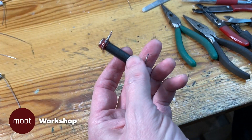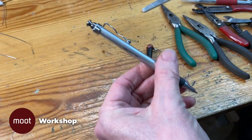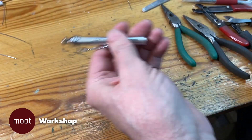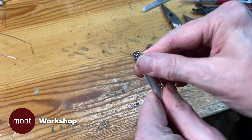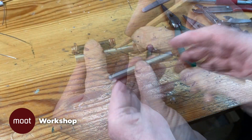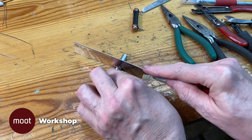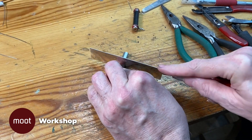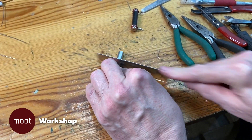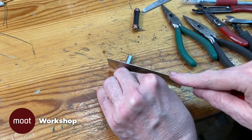Last but not least, I have to address the final resistor. The reason I waited on this one is it's a little bit different — a little bit larger than the previous ones. Fortunately, I have this pen whose barrel is the right diameter, or close enough. So just like the others, I'm going to cut a piece out of this pen barrel. Then I have to figure out what to do about the end caps, because on the original they have metal end caps.